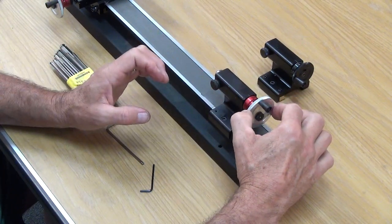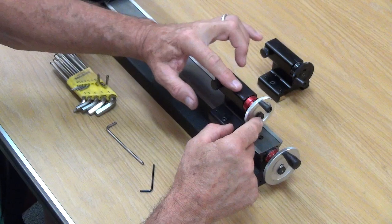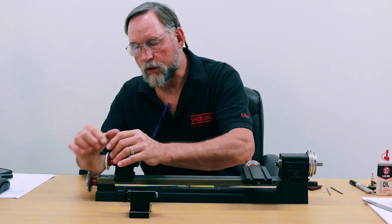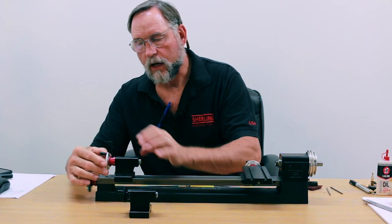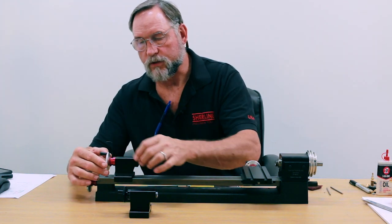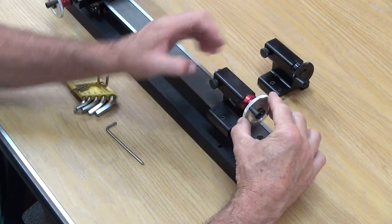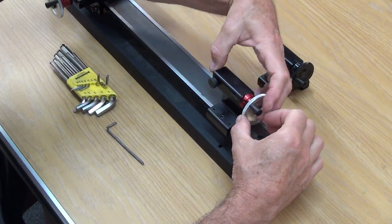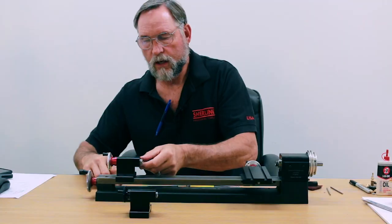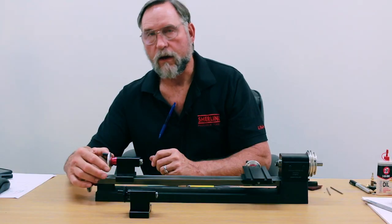What you do is get it close to the top, lock your spindle in place, and then turn a little bit — that forces the spindle out and the shoulder on the feed screw is being forced against the inside of the body. Then unlock it and lock it down again, but don't lock it down on the same indent that the original set screw made, so turn it a little bit to get a fresh place on the shaft of the screw and then pinch these both together so there's no backlash, and tighten it down. This went from almost two to about one thou worth of backlash.